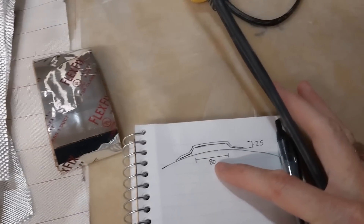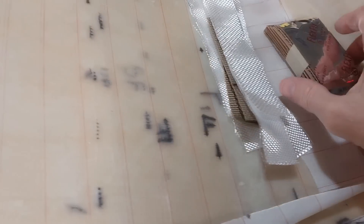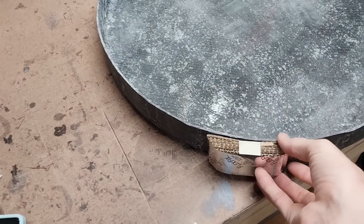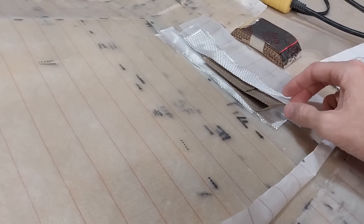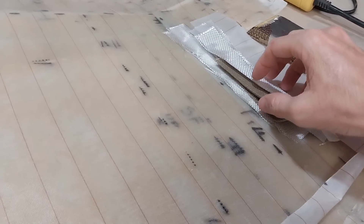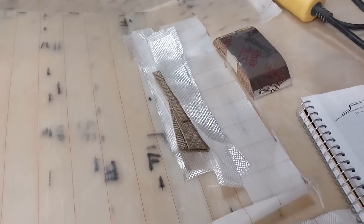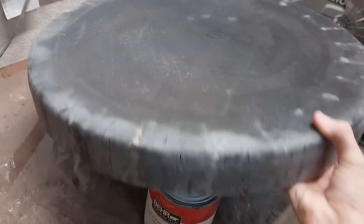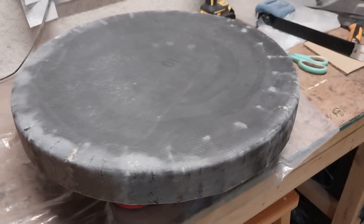Here's a crude drawing — just enough to fit my hand through. And here's the little mold I made for that. I'll rest it on here once the rim is thickened up, then add six layers of 10-ounce and 6-ounce cloth and three pieces of synthetic webbing. That should do the trick. I've given the lip a little sanding to get off any rough spots, and I'll see you after this lamination.